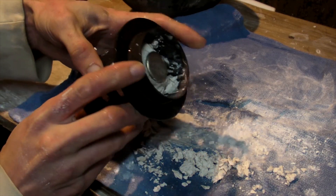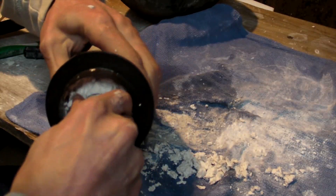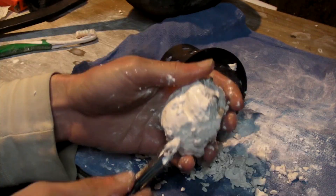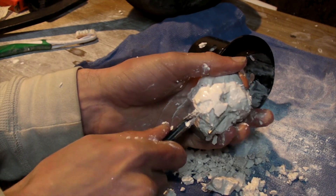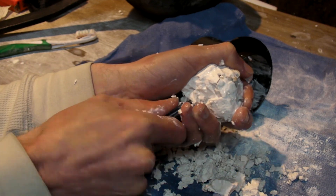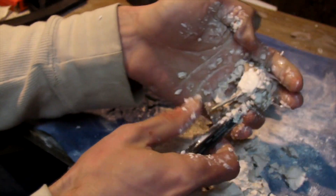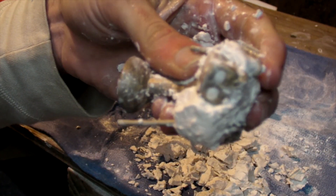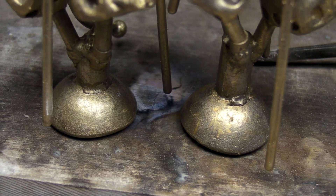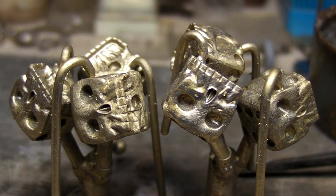I always add a small amount of boric acid to the investment when casting resin parts. It makes the investment very hard and very difficult to break free. To see a successful casting brings a sense of relief and accomplishment — it's finally knowing that all the careful preparation and hours of waiting have paid off.